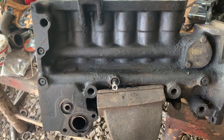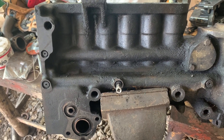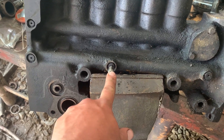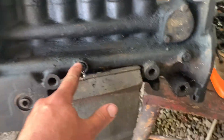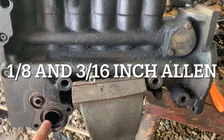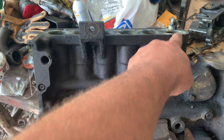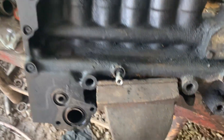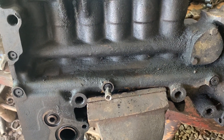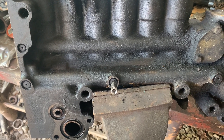I've done got the pump tore down. Now we're going to the cleanup process before we reassemble. You've got oil galleries and fuel galleries. I'm pretty sure that's oil — I'll verify. Take this cover off. Super clean. I'm going to have to buff the top of that off to make sure that no chance of grit, debris, paint chips, or anything gets in there.